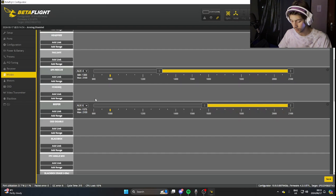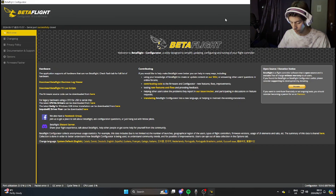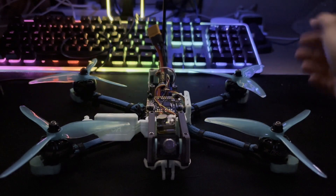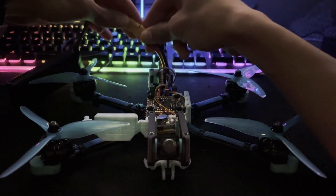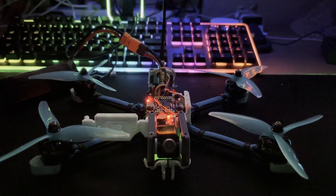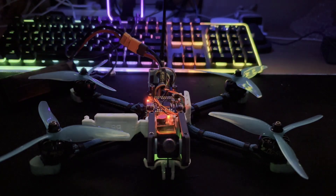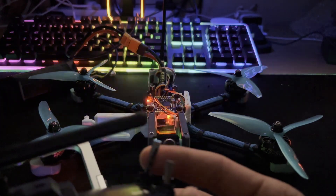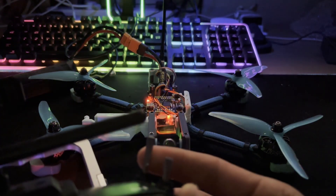You don't have to set up the auto-beep on Betaflight — that's pre-programmed into the finder buzzer itself. That covers connecting it to the Betaflight AUX channel for normal switch-activated beeping. Let's do a quick test: I'll disconnect from Betaflight, reconnect the quad, and there's the finder buzzer beeping on startup as it should. Testing the switch — that's working just fine.